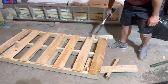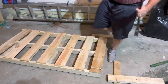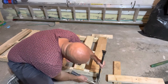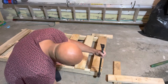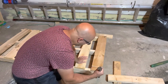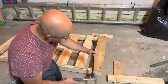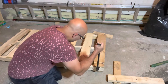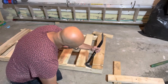Now we have a gap — I can feel the gap right there. I'm going to remove this wood over here and now we're going to lift this side up. I'm just going to give it a couple of taps and then prop this board up a little bit. You want to do this slowly — if you want to preserve the wood as much as you can, you want to do this slowly. That's the key factor here. If you do it too fast, you're going to crack the board and your pallet will be destroyed. The board is slightly cracking over here because I'm going a little bit too fast, so I've got to address this other side to save the board.